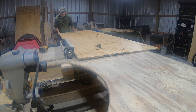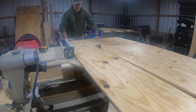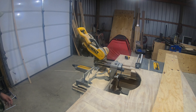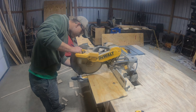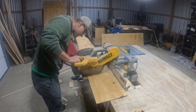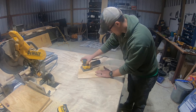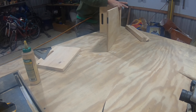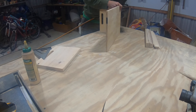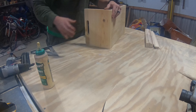For each of these crates, let's cut a piece of half inch plywood that's 11 and a half inches wide and 16 and a half inches long. You might find this piece easier to sand right now too. I'll just use an 18 gauge brad nailer to assemble this thing — you can definitely use finishing nails and a hammer, but this is definitely the fastest way to go.